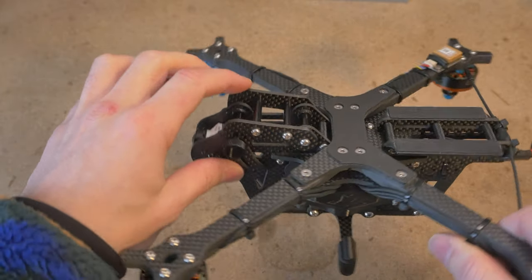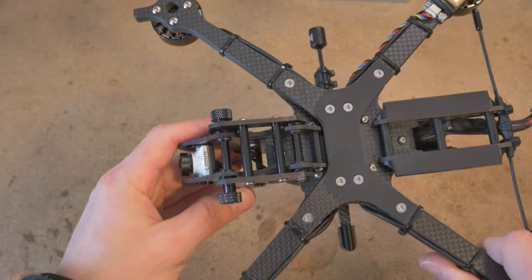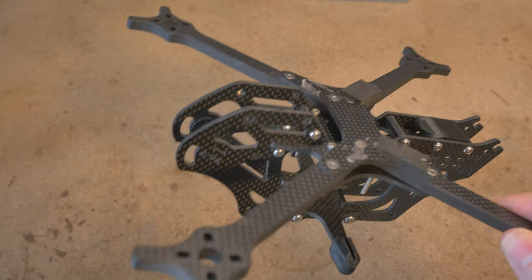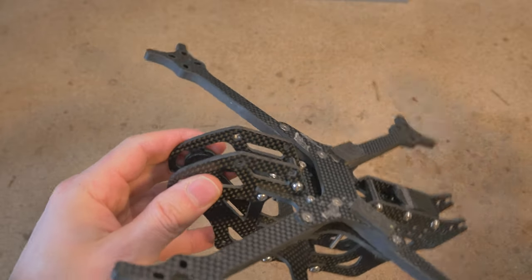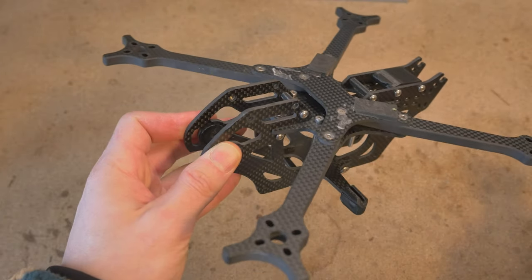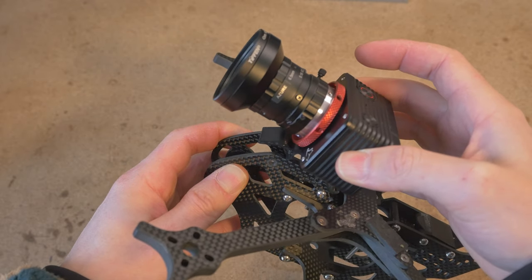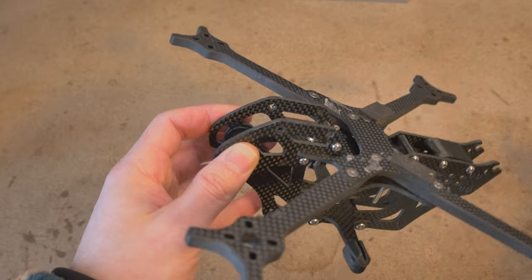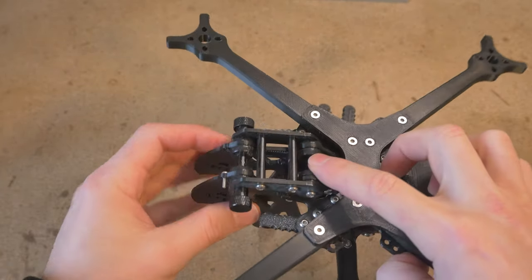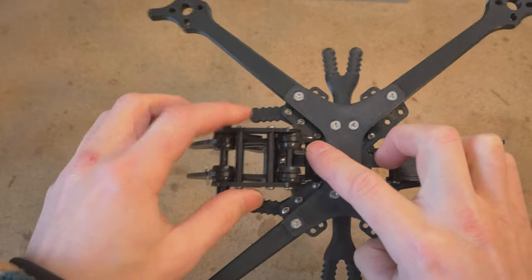Let's talk about the camera mount, because it's the most exciting feature of this drone. The original design actually had a rigid mount for the camera and it was meant for the Sony RX0 II. But I found that using 6 and 7 inch props the rigid mount was not adequate for getting rid of the jello to have perfectly smooth footage — I was only able to achieve this with 5 inch propellers. But since 5 inch propellers just wasn't enough to carry the Sony RX0 II with the power I wanted, I wanted to come up with some kind of soft mounting solution.